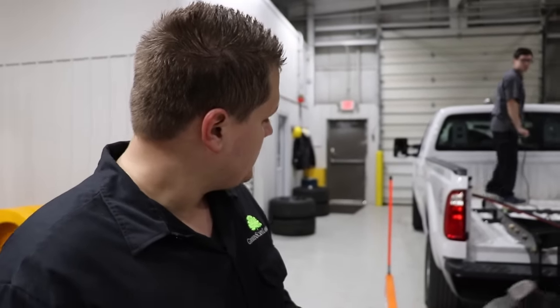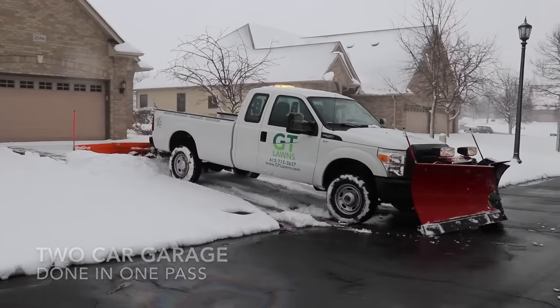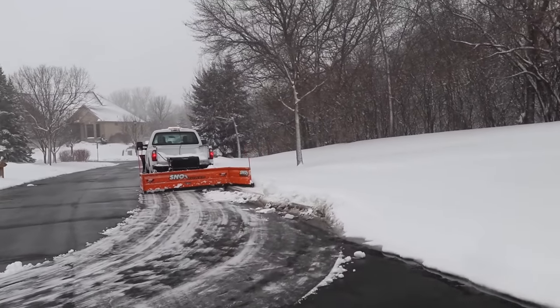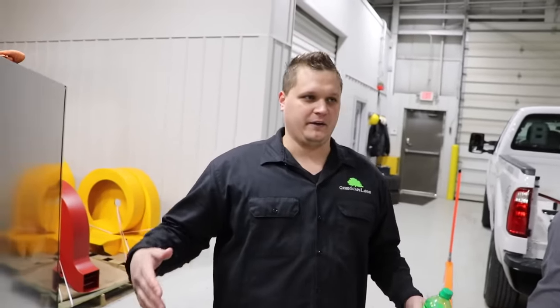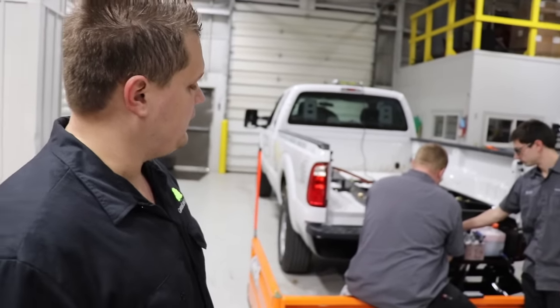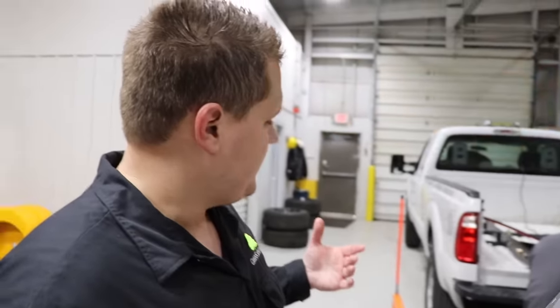The wing release — you're at a 45, you hit an island, car, whatever: your wing is going to release instead of breaking your shear bolts, shear pins, anything. That makes the whole blade. Why do you have five of them? Because you virtually have no downtime anymore. The old style, you'd constantly be breaking wings off, wing bolts, shear pins — your blade would end up bent because nothing gives. With these, the wings give. This is all in this fifth-wheel rail hitch system that's mounted in the truck and the plow hooks into that.